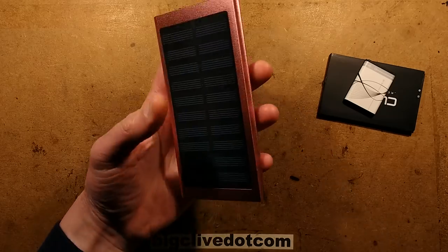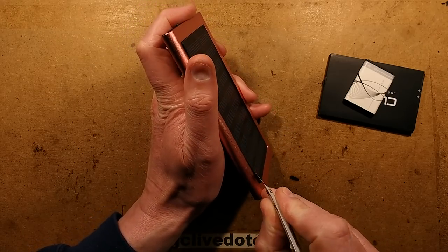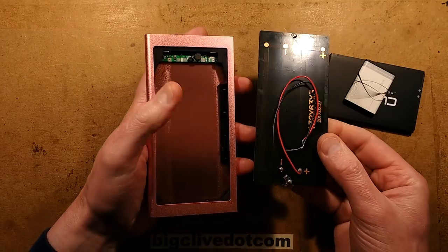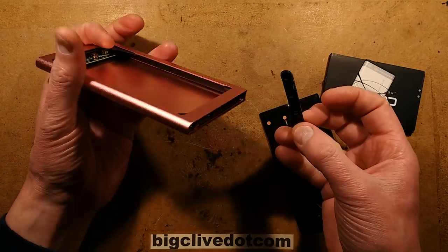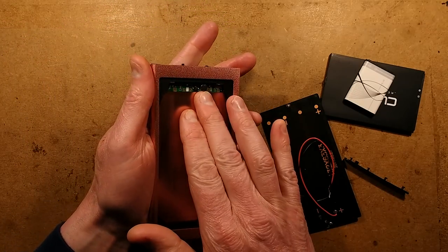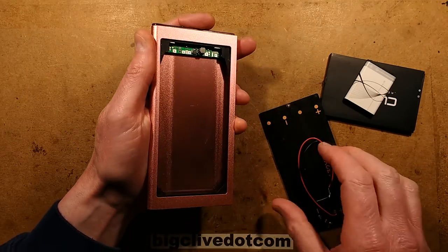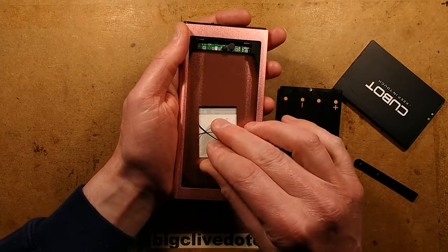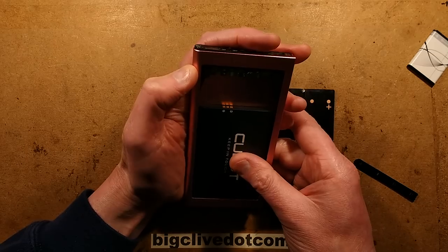When you open this up, the solar panel is clipped in gently. I've already attached a couple of leads onto the solar panel to test its output, and to be honest it wasn't that impressive. There's a small end plate that clips in with little pins to lock the drawer in place. When you slide it in, the corner points support the solar panel — you basically put a dab of glue on each corner and put your battery inside. It will accommodate quite chunky batteries, so it could theoretically have a decent capacity.